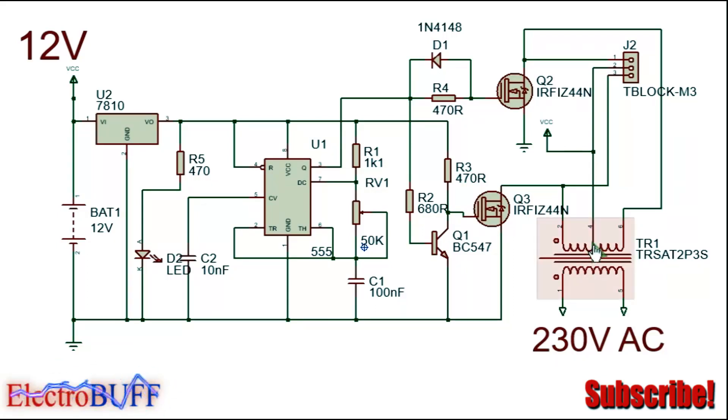You can have the primary windings with about 10 turns on each side and the secondary winding with about 200 turns. If you want any other voltage, just calculate the ratio between the primary and secondary windings — the output will be directly proportional to the transformation ratio.